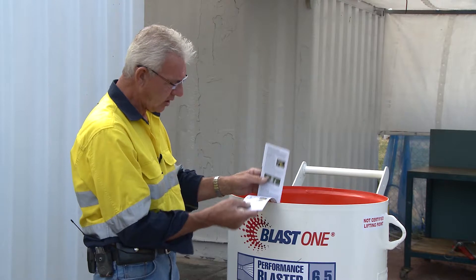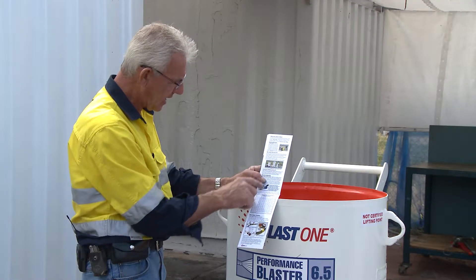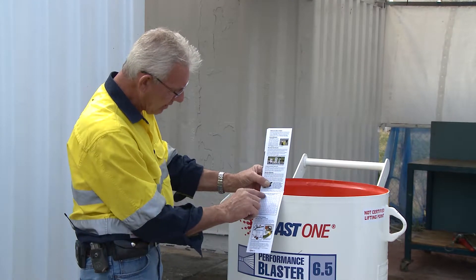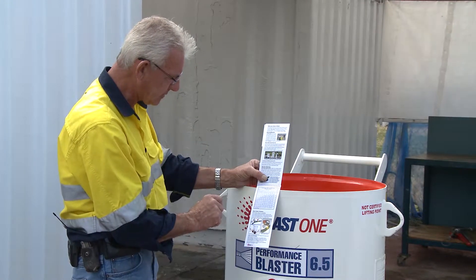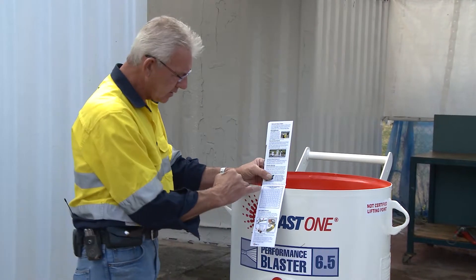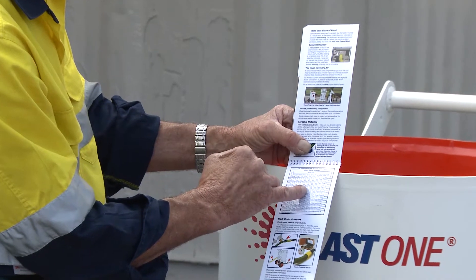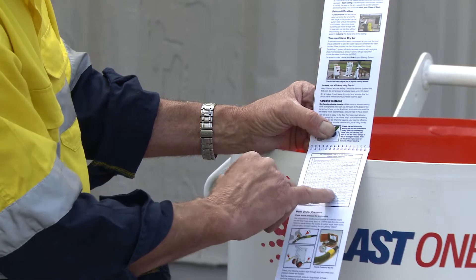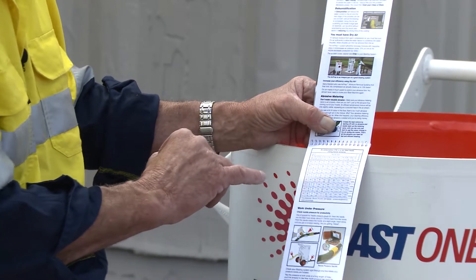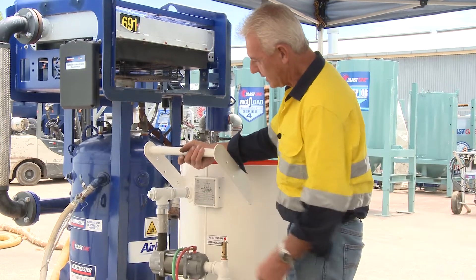This book also has a lot more information on setting up your equipment and what you may require — it nominates an air prep as mandatory. It also gives a brief description on the valving, which meters the amount of abrasive coming through the blast line. More importantly, there's a chart that gives you an indication of air consumption. Nozzles go from a number two, which is one-eighth inch, right through to a number twelve, which is a three-quarter inch nozzle. Today for example, we'll be using a number seven nozzle blasting at 100 PSI, so we'll need a 312 CFM compressor. I must ensure I have appropriate air pressure and volumetric air to facilitate the appropriate outcome for this blast nozzle application.